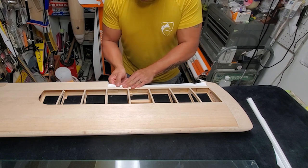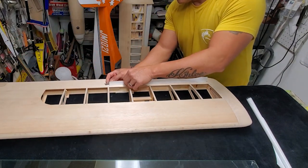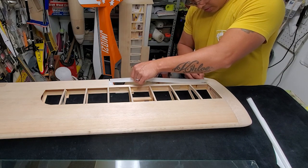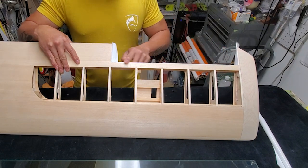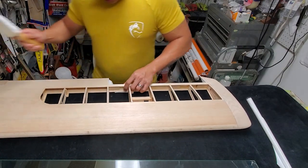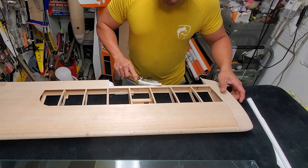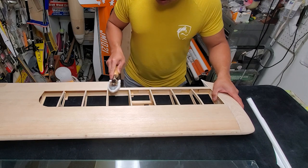This is where I want to make my cut. So I grab my single edge razor blade. I'm gonna put it down, pull in my monocoat, and I'm just gonna glide all the way down the full length, not stopping, just like that. All right, and you'll see basically a really nice clean edge all the way around, and then eventually we'll take our sealing iron and we'll just basically seal this completely, that edge, really lock it in onto the wood here. All right, that's all we're doing, just really securing this edge.